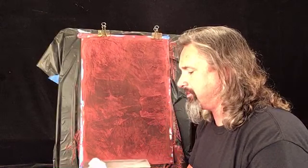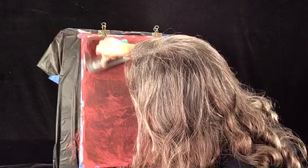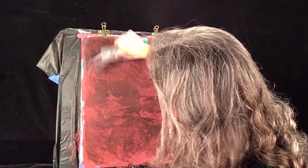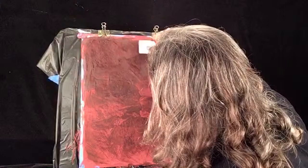Put just a little bit of wax — I have to wax over this sample board. A little bit of wax goes a long way — a gallon can do about 800 square feet. I put it on the same way as the plaster. I don't apply it with a rag because all that does is pile the wax on, you use a lot more wax, and it has more of a plastic feel to it.